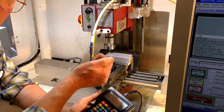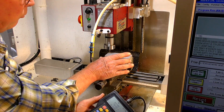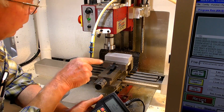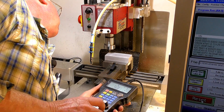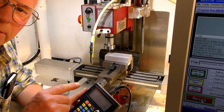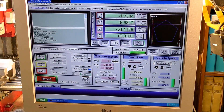As I'm turning this, it's only moving a couple of thousandths of an inch — very, very accurate. I know I've got about 5 millimeters of extra stock material, so that's why I'm going slightly over that way. And that's pretty right there. So now I'm going to set the X and Y zero position. In Mach 3 it's very simply done just by pressing X and Y. First we need to get rid of the file that's in there — close G-code.